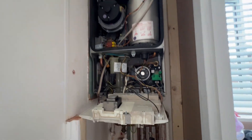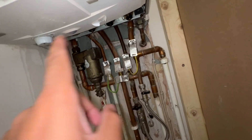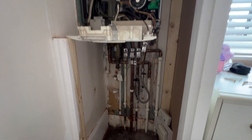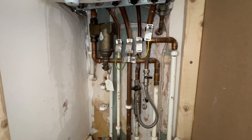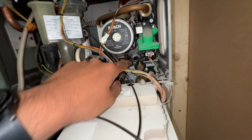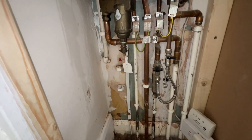What we're going to do is drain down the boiler first. We're not going to isolate the flow returns because the boiler is higher than any of the radiators in the room, so no need to do that. Water's already been turned off downstairs. Now I could drain it from the drain off, but I prefer to drain it from the filter — it's just easier.